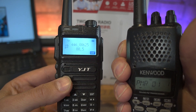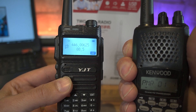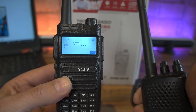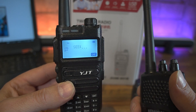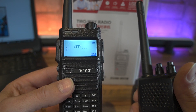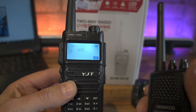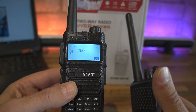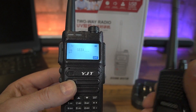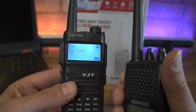Let's try that again - and there you go. It may also depend how far the antenna is from the other radio, because you do need to be in pretty close proximity for this to work successfully. But it is a unique feature, and one I've not seen inside such a low-cost transceiver before. It's handy for working out what's going on with a particular radio if it's one without a display or you haven't got the programming cable. If you just wanted to clone a PMR radio very quickly to use with a load of other radios on the same frequency, you could use this - it's a really good little feature.